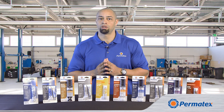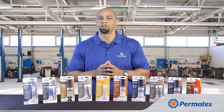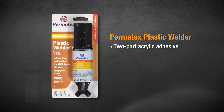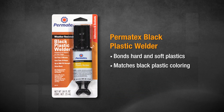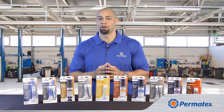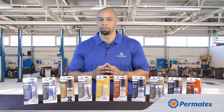In addition to our general purpose liquid epoxies, we've also got some special purpose adhesives. Permatex Plastic Welder is a two-part acrylic adhesive that bonds hard and soft plastics to each other and other materials. Our Black Plastic Welder does the same, but lets you match the color of black plastics — it's actually the only true black acrylic adhesive available today. Both of our plastic welders work with a variety of plastics, but they're not designed to bond polyethylene or polypropylene.